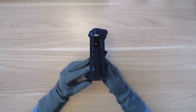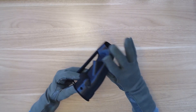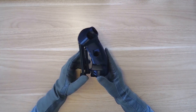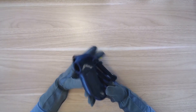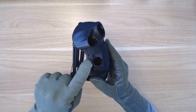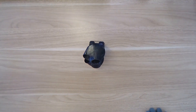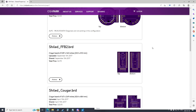We are assembling the F-4 Phantom style B-8 grip today. First things first, we're going to grab the printed shell. This is what it's going to look like once it comes off the 3D printer. Print settings are up to you and dialed into your particular printer — I have a Voxel Lab Aries, so I find that 0.2mm layer height with 15 or 20% infill is sufficient. We've got some button openings here.